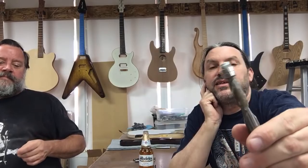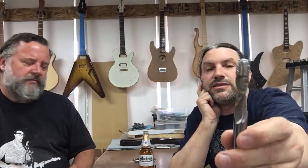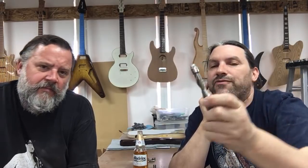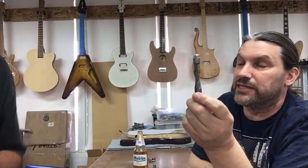We get a lot of questions about these bits. This is a spiral up cut or spiral down cut bit — I'm not sure which. We have one of these in our router table at all times. It just makes a cleaner cut, comes off the router almost ready to go, no sanding required. It greatly reduces tear out. Remember, it's still only a half-inch diameter cutter, so you're not completely eliminating tear out — but here's a quick factoid about why these are so expensive.